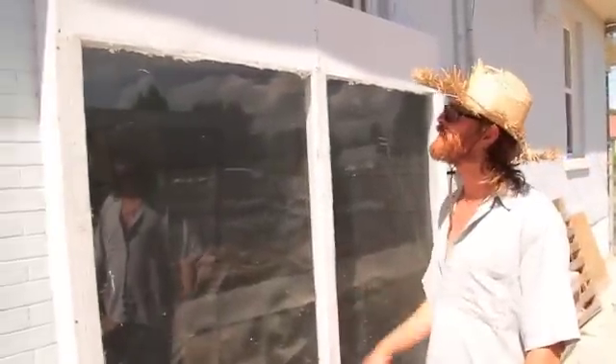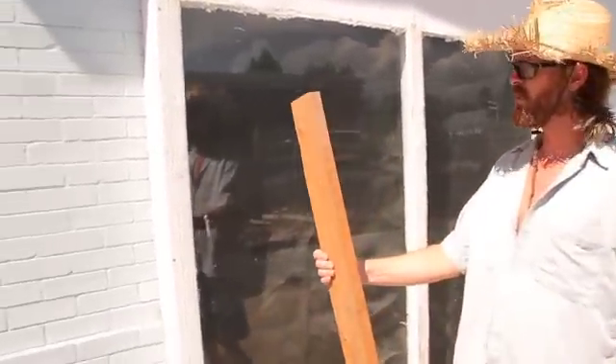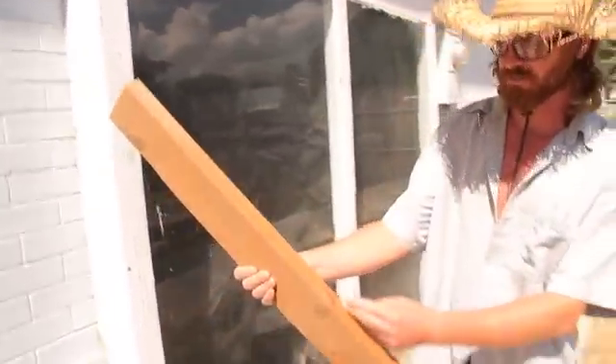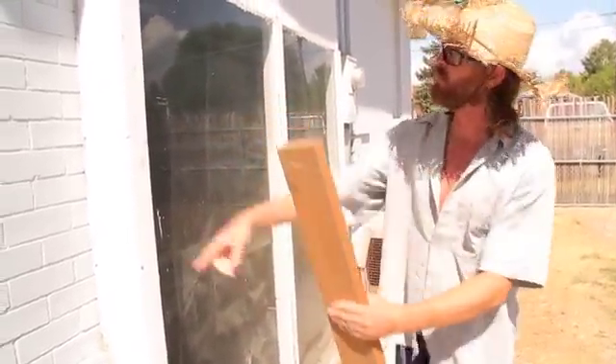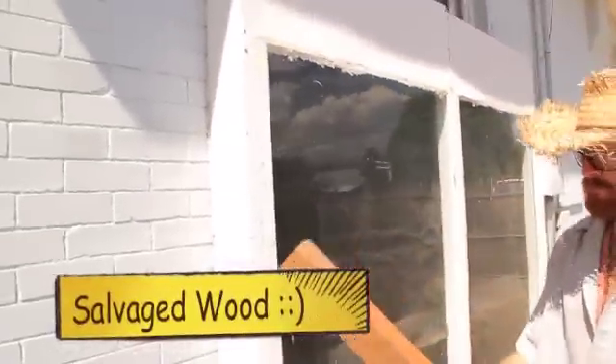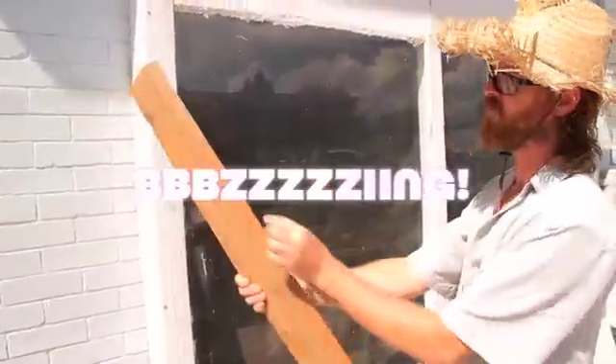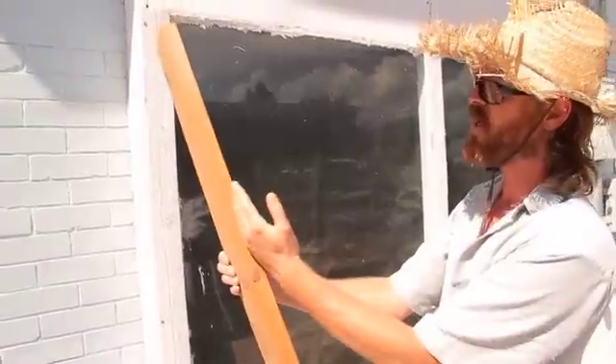To build one of these, it's pretty straightforward. I used a table saw and took some 2x6s and essentially just ran a groove down the side of one of these boards — you just put it on the table saw and zing, like that. So you've got this nice notch right here.